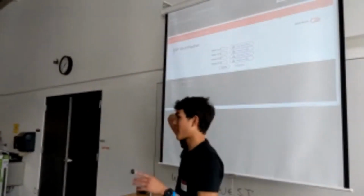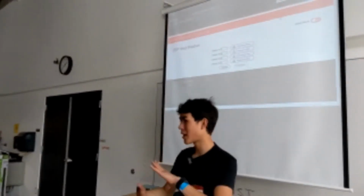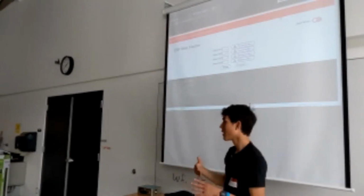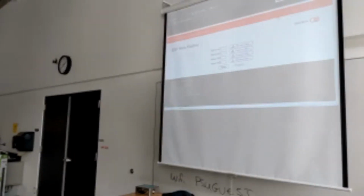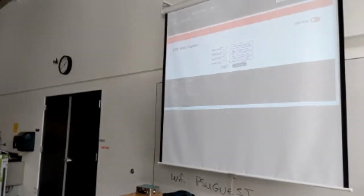One thing to note, if you guys are having trouble with that, I believe I actually flashed a default firmware to your guys' Nugget when you plug it in. That has like a QR code that pops up. So for safety, you might want to hit erase first to overwrite the firmware that's already on there, and then flash the new file. I'd recommend doing that. But yeah, after that, you can just select the binary file that you guys downloaded like so, hit program, and then it's pretty much good to go.